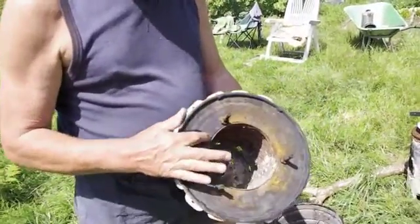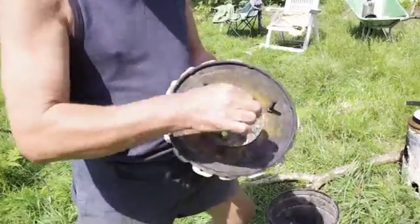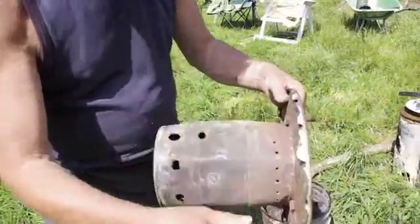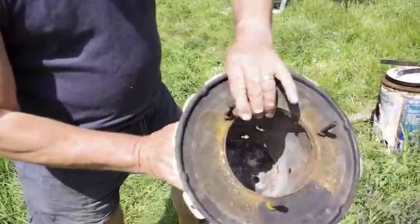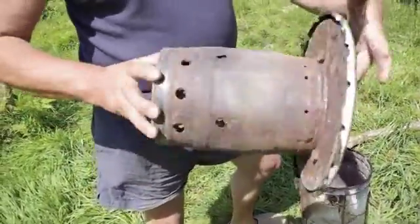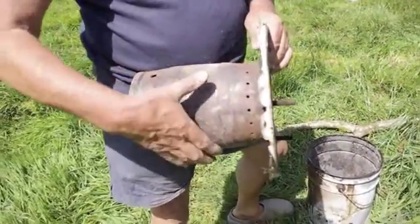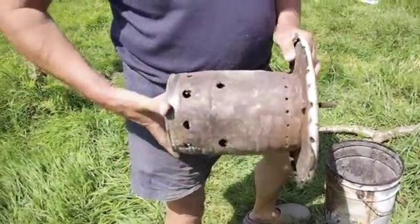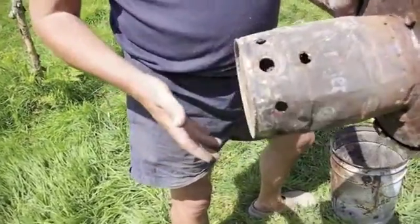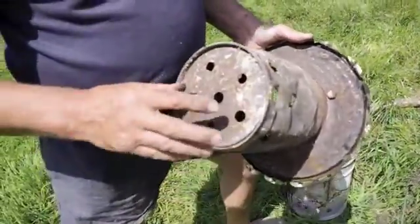I made this hole with a sort of metal chisel, bit by bit, quarter of an inch by quarter of an inch all the way round, then flanged it down. I made it fairly precisely. And inside it I fitted this old beer barrel — it's a little beer barrel but it's quite strong, stronger than the average tomato tin. And in this tin here I've drilled a whole lot of holes. This will be for the primary burn, as they call it.